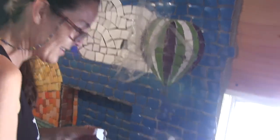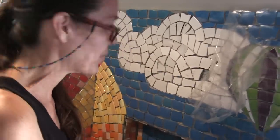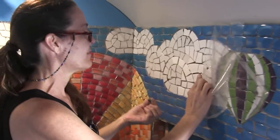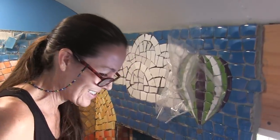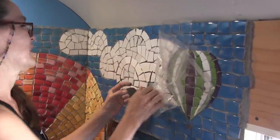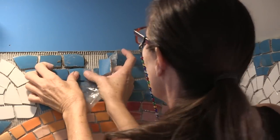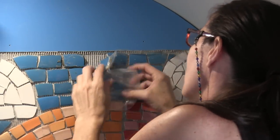None of them want to stay — it was a rebel patch of tiles banding together, trying to overthrow the shower. I just cut myself. I'm glad it's an easy fix — all you have to do is spread a little thinset and stick it back in. I can see why these ones popped up: they're all convex, so there are hollow spots underneath them. It needed thicker thinset, and then it would have stayed wetter longer too.